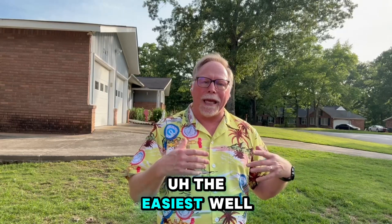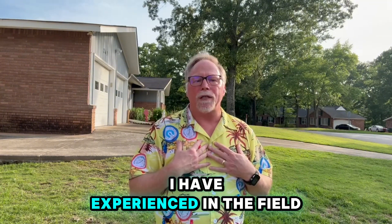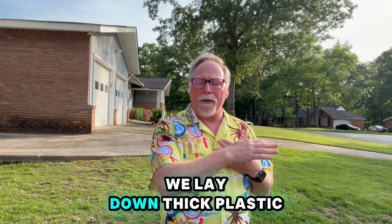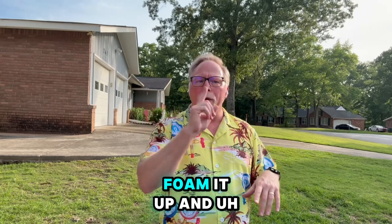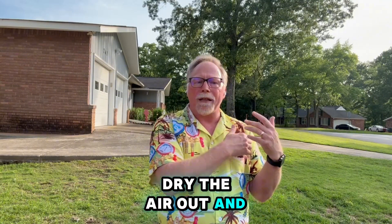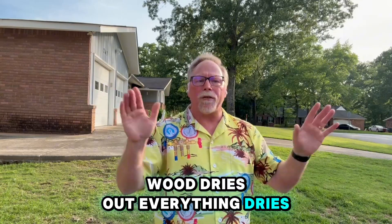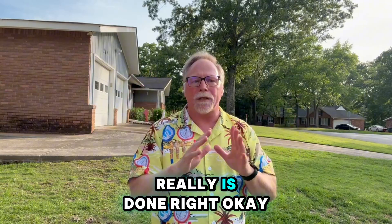There are ways to control that. The most simple and effective way I've experienced in the field is total encapsulation — you lay down thick plastic under the house, seal up all the crawl space vents with foam, and totally enclose the crawl space. Then you put a dehumidifier down there to dry the air out and you're golden. The wood dries out, the insulation dries out — it's a magical thing when done right.